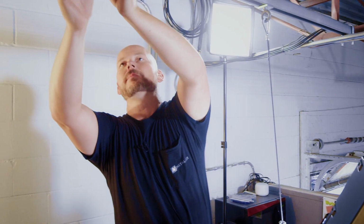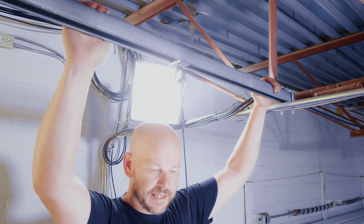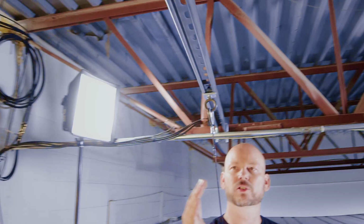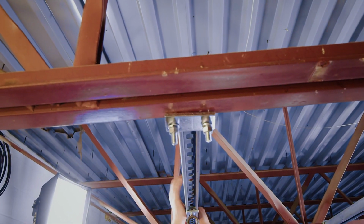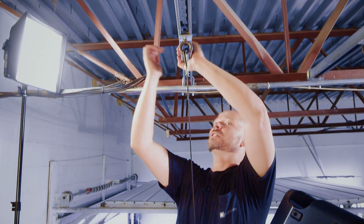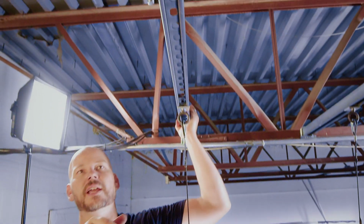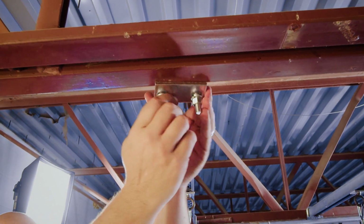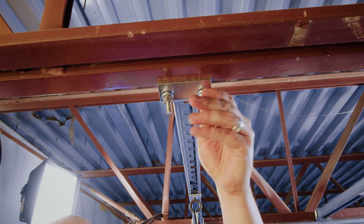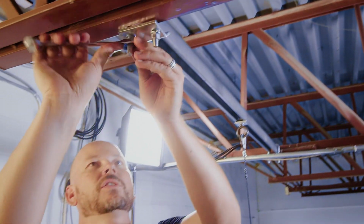Okay, so remember I talked to you that we're gonna do the back. We're gonna tighten it later. It's really important that if we look at it from this direction, everything goes as straight to earth as possible. So if you see here, now this line is going straight down, and now I can tighten this back beam knowing that all of my lines are straight to the ground.